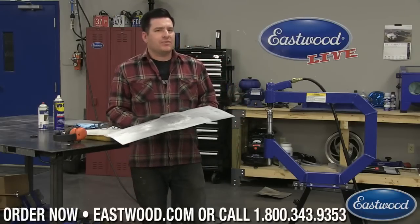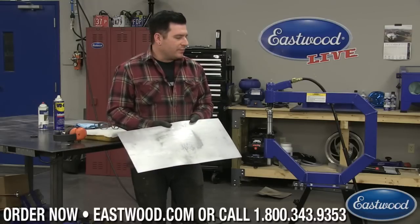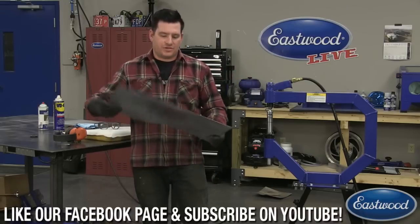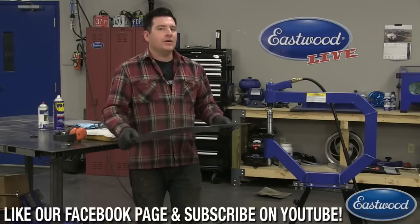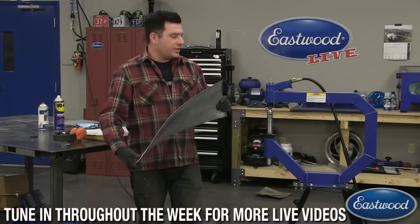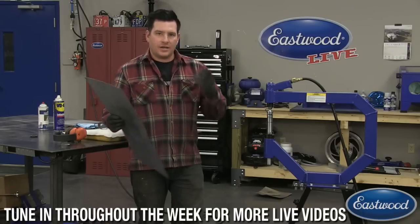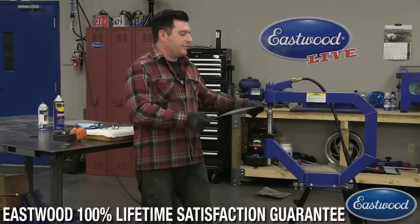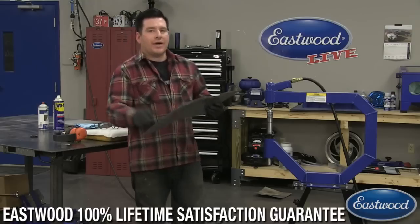Shrinking can be done with a planishing hammer, but it's quite difficult. I haven't tried it too much with this particular hammer. It requires a little bit of skill of actually putting a tuck in it and then actually crushing the tuck out. So it can be done, but it's not something that's real easy, and it's not a traditional way of shrinking. But you can make a tuck with a tucking fork or in a stump, and you can fit it in the planishing hammer and kind of come up behind it and then actually hammer and pull it out, and it will crush.